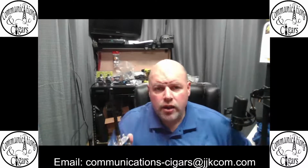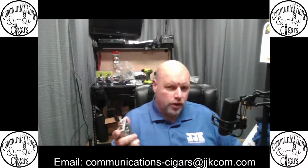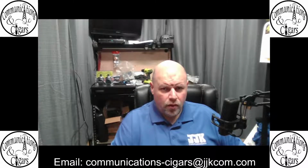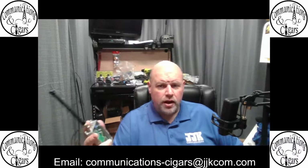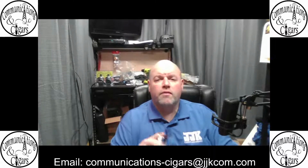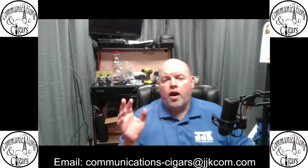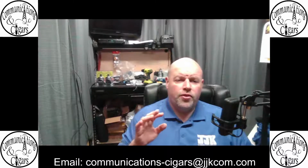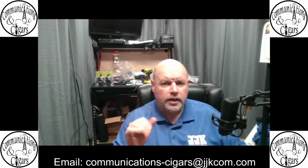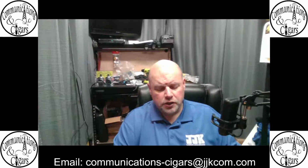And depending on what kind of radio you get, if you use an amateur radio, you may or may not have audio adjustments. If you get in and you start to interface it into, let's say, business or LMR or public safety based radios, there may be software adjustments you can do. You may be able to take it and put it into flat audio in versus a modulated type audio that needs to go in there. So there are lots of different little things that you can go ahead and integrate and do with these after you set the audio, and really the sky is the limit on there. But this was, I thought, kind of fun just to do a little project on the bench here.